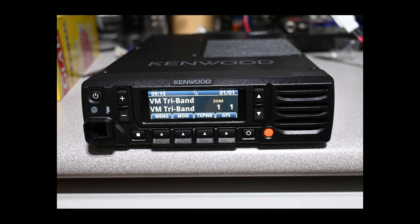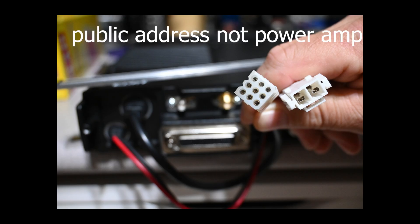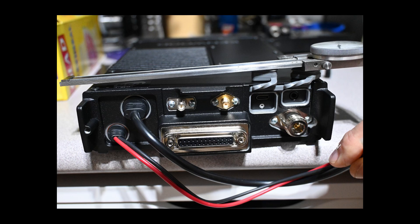The audio power amplifier is capable of 15 watts of audio, so we're definitely going to be remoting a larger speaker. The mic port is an RJ45 and it's reinforced around its perimeter. The 12 programmable buttons are of the rubber membrane variety and the display is of a sufficient size. The rear of the radio features two leads: one for radio power and the other is a 9-pin Molex connector for speaker and power amplifier audio, ignition sense, horn ring, and ground. We have a TNC female connector for RF, an SMA female for GPS, and a reverse polarity SMA for Wi-Fi. Just underneath that we have a DB25 female for accessory connections. Under two covers we have a USB-C programming port and a 3.5mm audio jack. Note that this radio uses balanced audio, so when connecting to test equipment ensure you're using an isolation transformer.